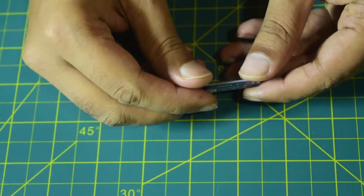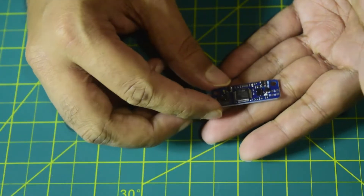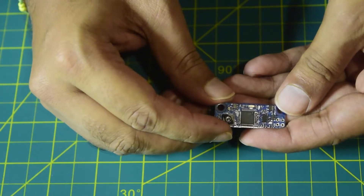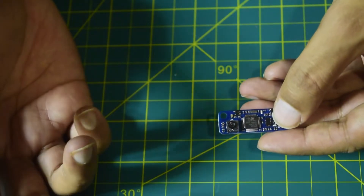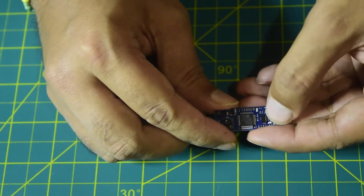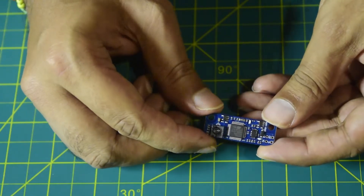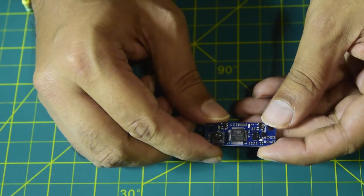This sensor is really small — it has a wider width but a very lightweight of around 2 grams only, so it will not weigh a lot on your drone frame. It comes with two sensors on board: one is the optical flow sensor which is the PMW3901, and the other is an onboard LiDAR sensor for range finding, the VL53L0X, which has a range from around 2 centimeters to around 200 centimeters — that is 2 meters — for altitude hold.